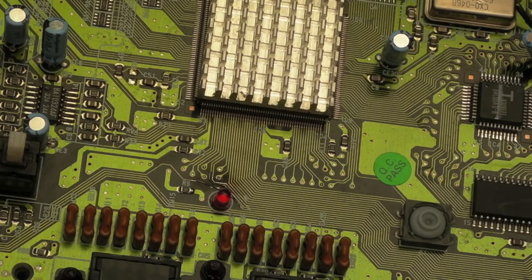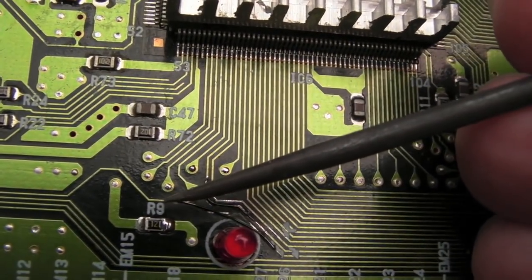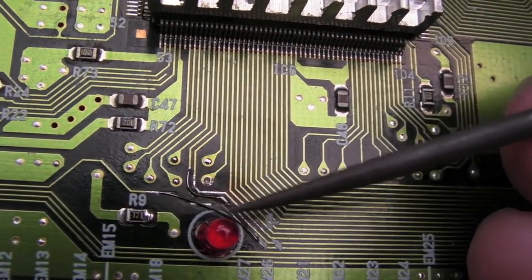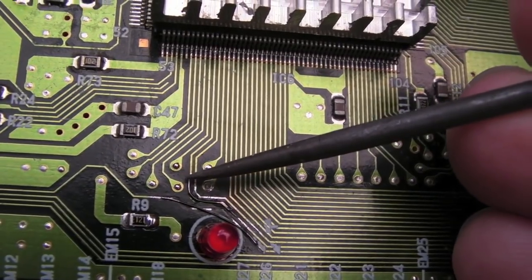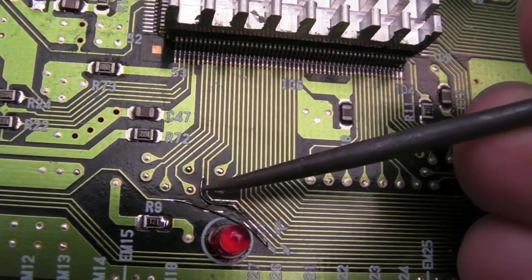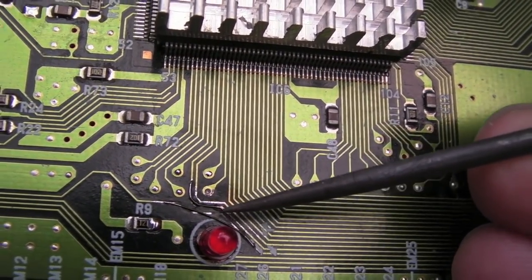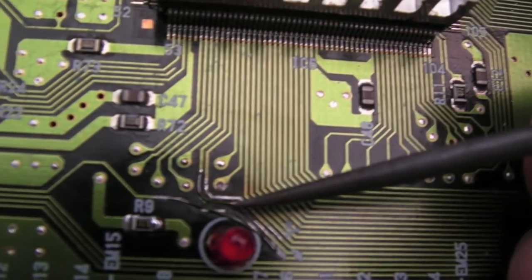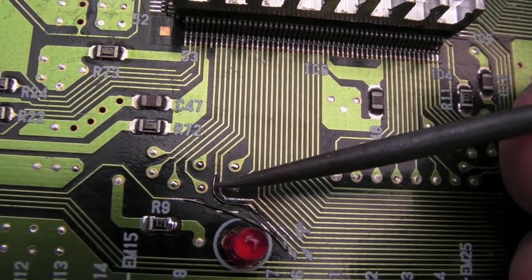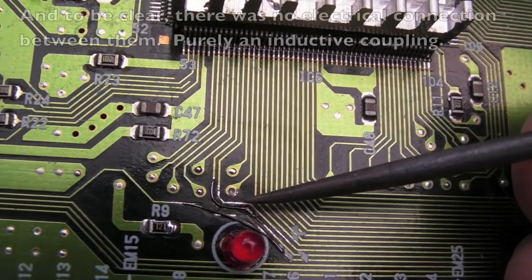I've just shifted it. Okay, so you're on the macro now. You can see that the wire here is okay. If you look where it goes, it's just coming down here to this outer trace. That was not a problem. Now this one, can you see I've straightened it? I pulled it down a little bit here, so it had a bit of extra length, so I could bend it around and follow the trace here. What was happening previously, and you may have seen that on the previous footage, it was overlapping. When it came down here, it was overlapping this trace here, actually on this corner. And that was what was happening.